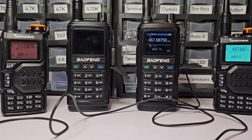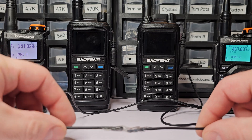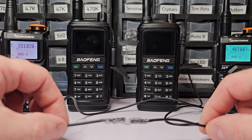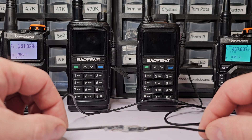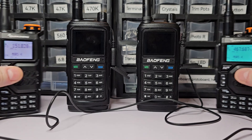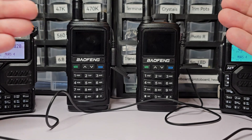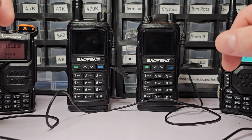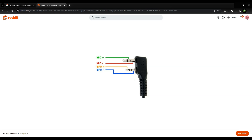I did all this with just the stock accessories. I did a crappy job making the wire, and the radio noise you hear is because I'm triggering the VOX system — meaning I did a bad job with the wiring. Both repeater radios are set to VOX; the radios you're using to talk into just use PTT. VOX setting two seems to work well — it keeps background noise out but still triggers easily.